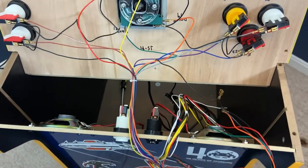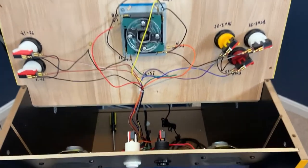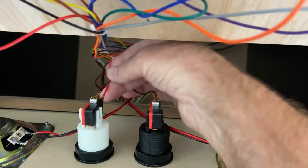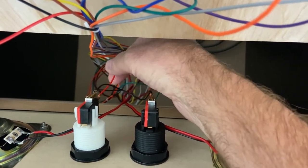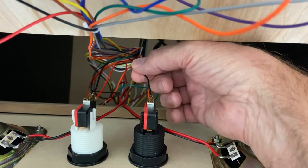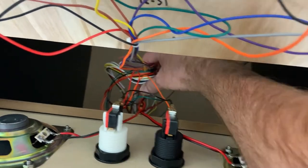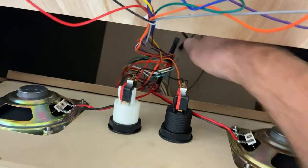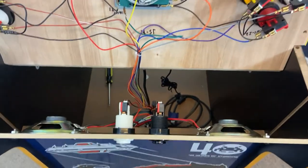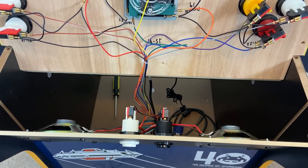Let me connect those and I'll come back to you. Now we've got the service button — the white button — connected to the red wire, and the test button connected to the orange wire, with the black ground from that same sub-assembly. It's all connected, and I've got all the harnesses lying inside the cabinet. So we're now ready to move to the back of the box where we're going to install the 60-in-1 board, the amplifier, and the power supply.